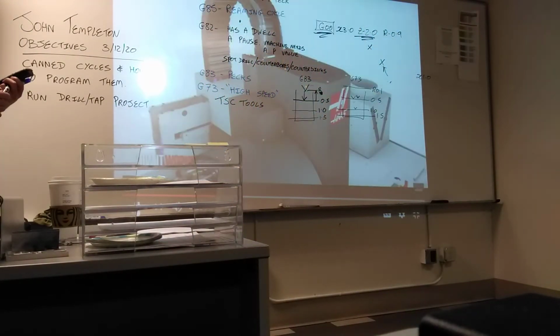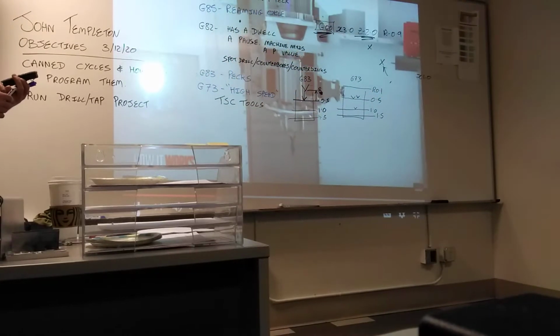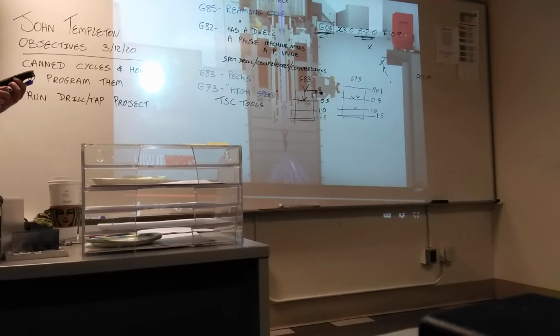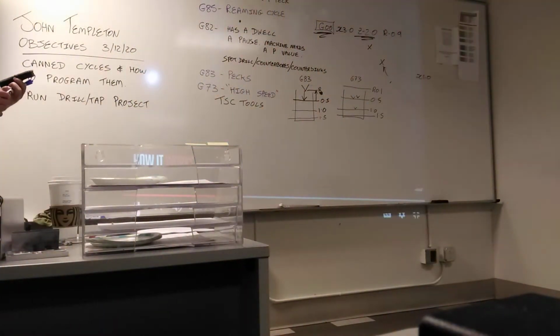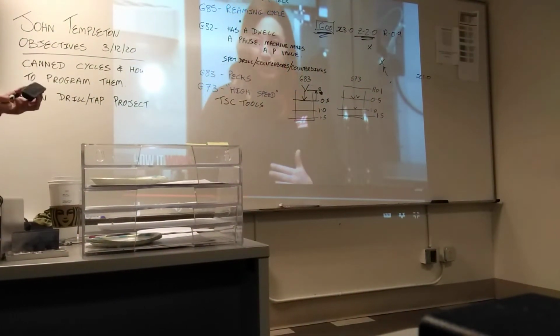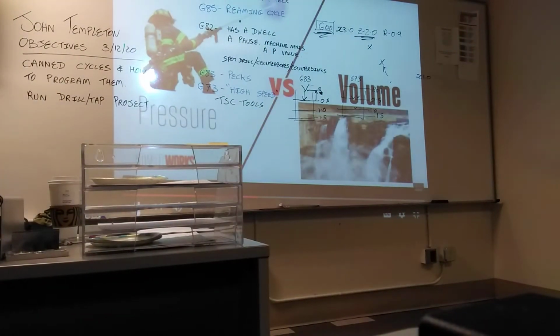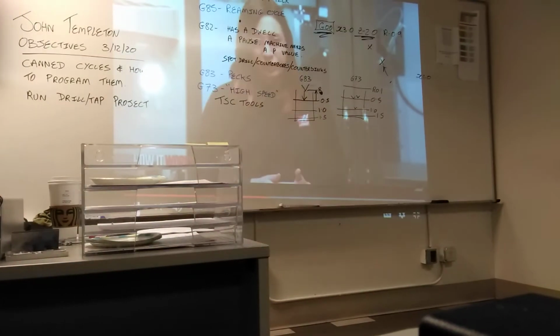The pump is the heart of the system, pulling coolant from your coolant tank through the spindle and into your tool by way of a rotating union and high-pressure hoses. Now we get to the part that is often misunderstood: the relationship between pressure and volume, and how this relates to the tool you choose and the orifice size in that tool. The pressure you actually get at the tip of your tool will vary.